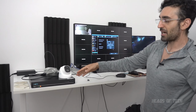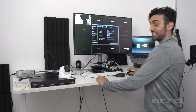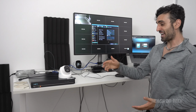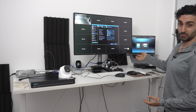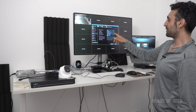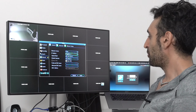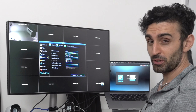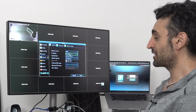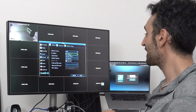So now it's kind of set up and up and running. I want to see how to access it using my Mac. All right, managed to get it working. So if like me, you want to connect your NVR directly to your Mac, your computer, you don't want it going on the internet, online, all that kind of stuff, you have to give it a static network address. So I gave it the IP address 192.168.2.1 because my normal internet lies on 1.1. Do you know how to access the router? So I just give it 2. I'm gonna change that later because I obviously security risk.